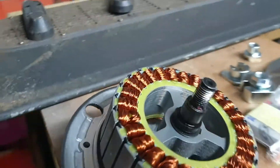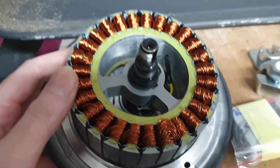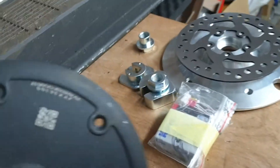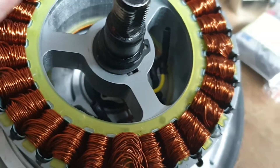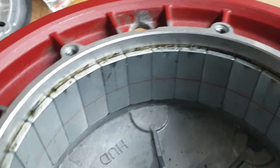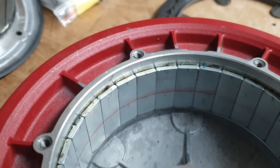So if you think you've got a problem with the motor, what are you actually looking for? Well, a visual inspection on the motor — you're really looking for any obvious signs: burnt coil, broken wires, any scraping on the magnets, any magnets off. Any of that stuff — obviously — that's the motor trashed. You're not repairing this.